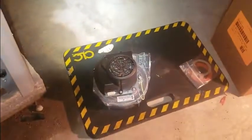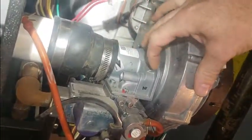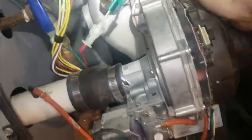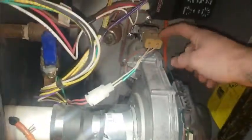Got the new one over there and I'm going to be swapping that out. That process entails removing some screws in the gas valve assembly and removing these bolts back here with Allen keys — there's four of them. I've done a few of these before. These are basically the weak link in these Utica boilers. That's the part I always see going, aside from the hot surface igniter — they tend to go a lot too on these boilers.